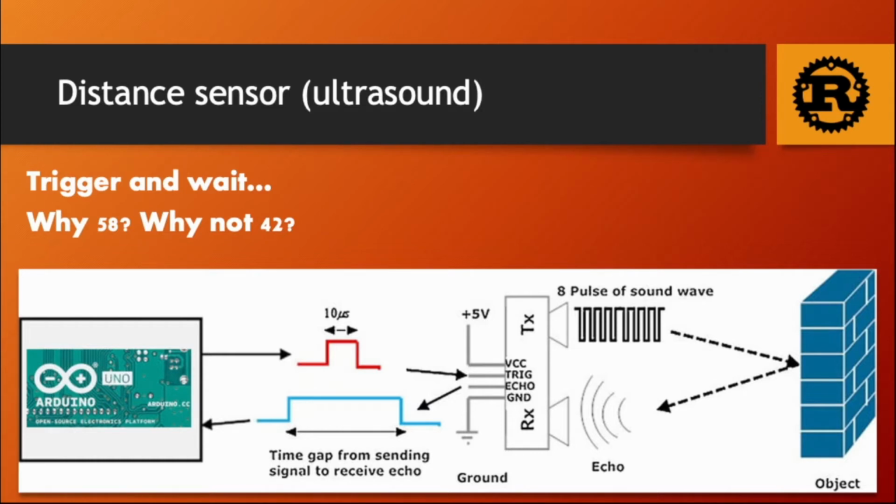There are many details, but I will just cover the ones I will show in the code. We will use a timer, another timer, timer 1. This one does not need as much prescaling as timer 2 that we use for the servo, so we will just make it 64 times slower.